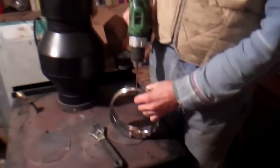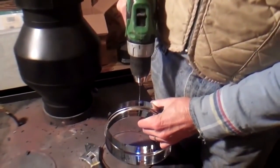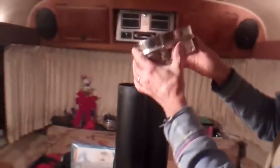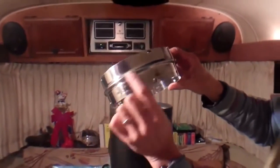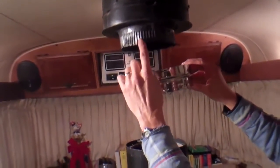Casey is drilling out the adapter in stainless steel. When you pre-drill stainless, the key is to use cobalt drill bits — normal high-speed drill bits do not do well drilling stainless. We've already pre-drilled the holes three times, and now we're going to transition from the fluted collar.